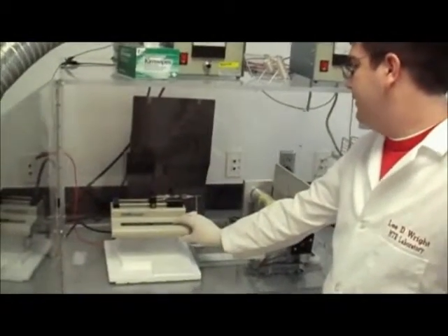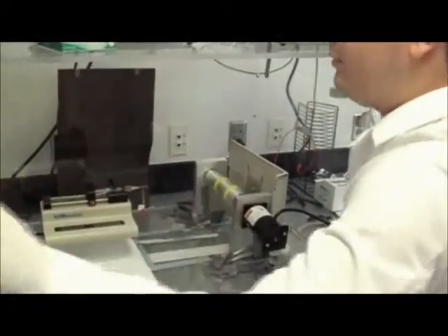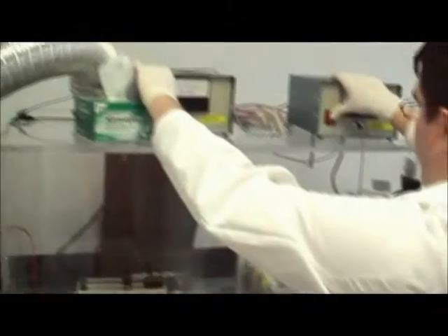What does PLA stand for? It's polylactic acid. To begin, we're going to start the pump up and then start the rotating cylinder, close the door, and turn on our positive and then our negative charge. We'll make up our speed a bit — and now we're electrospinning. If you look closely, you can see the mist coming off the tip of the needle. What that mist is, is tiny little fibers of the PLA. These fibers come out of the tip of the needle charged and work their way all the way over to the drum or cylinder, where they're collected as the cylinder spins.